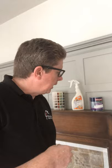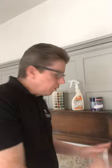When you're doing furniture, kitchens, fireplaces and stuff like that, you really do need to be careful. This primer is the most important coat, in my opinion. It has to be put on right the first time. With that much work to do on this fireplace, you'll get to areas where the primer's starting to dry, and then it's going to overlap, and you're going to see thick edges and heavy brush marks. So you really do need to know what you're doing.